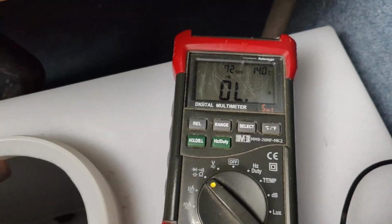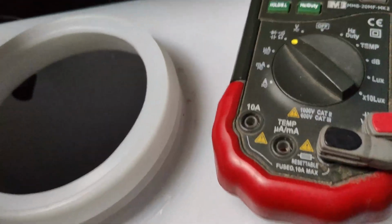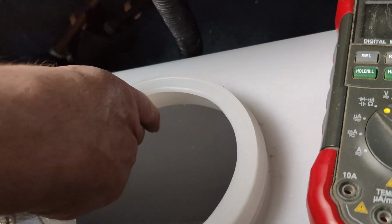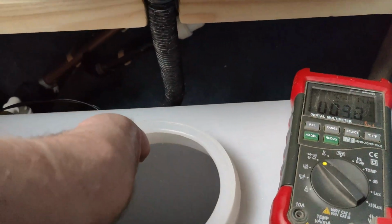Right, got all that connected up now, and got a meter connected to it so it buzzes. So that's contact when it's empty, so it can fill, and then as soon as it gets full it breaks contact and stops it filling, and I can just switch everything off after that. So that's just when I'm filling from a hose pipe. That's connected. Right, get it all wired in now.